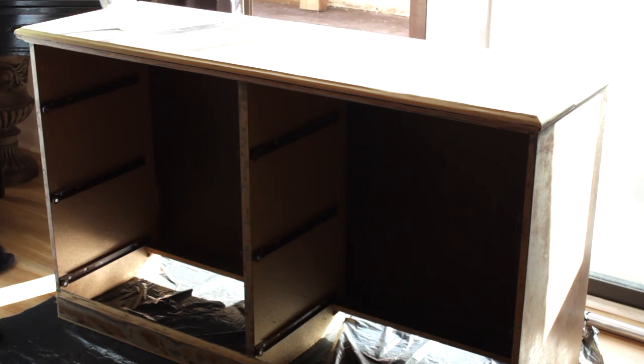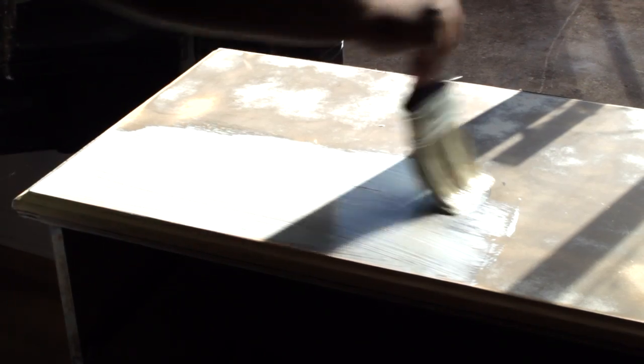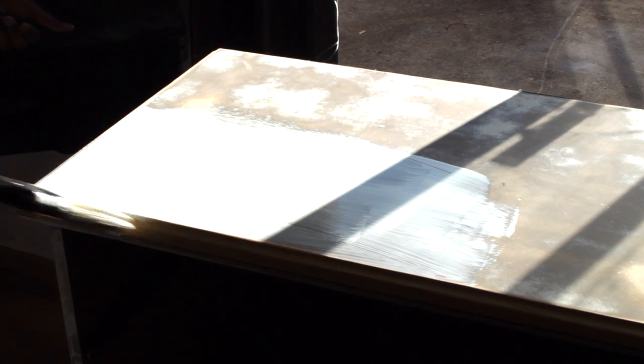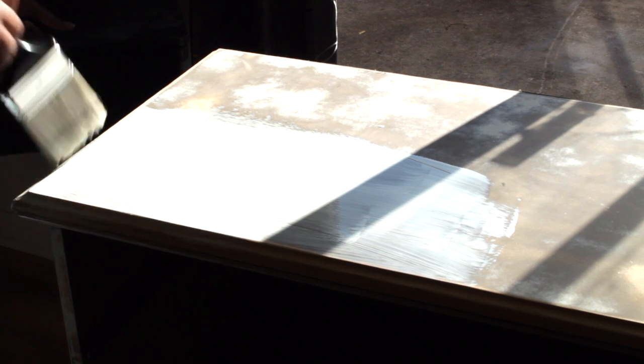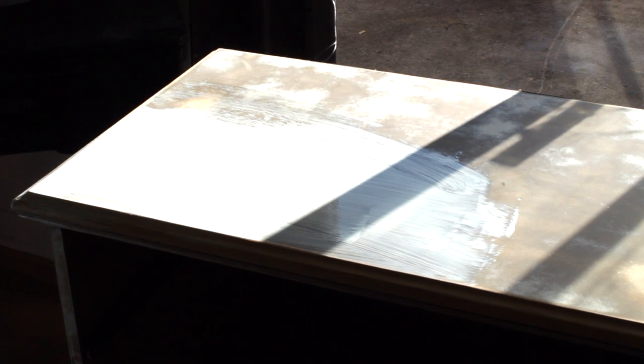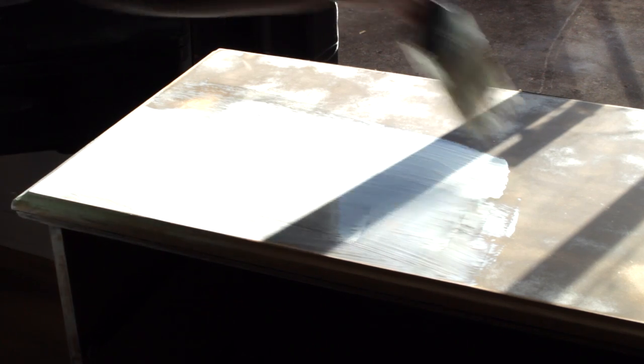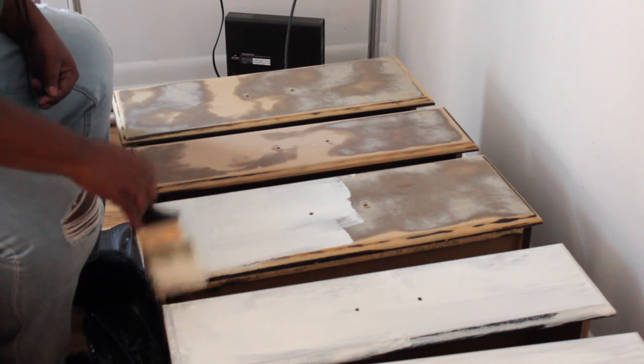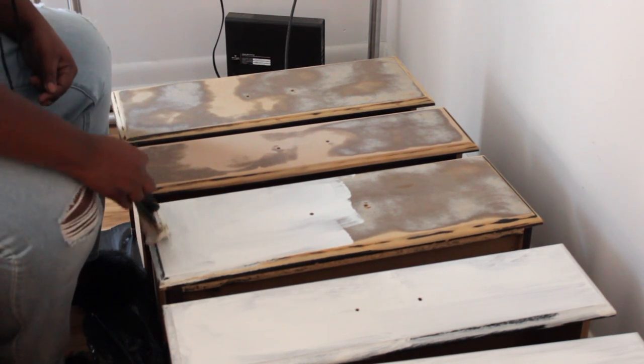Alright, now that I've got all my dresser drawers and my dresser sanded, I am going to take my time and prime this dresser so that my paint does not chip off. So you're going to take some primer — I have the information for the primer, I'll link it below. I just grabbed the first primer I saw at Home Depot. I'm going over my dresser now with the primer — make sure you go over the top, the sides, and the bottom bar, and also go over the dresser drawers as well.